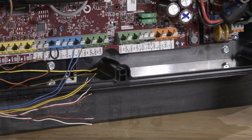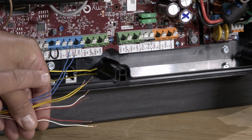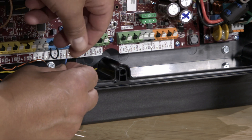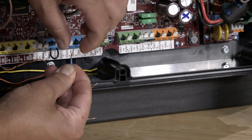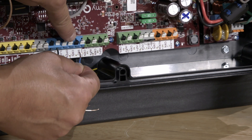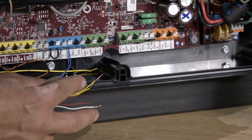Once at the power head, we will wire all open and closed circuits in parallel. To do this, twist the blue open wires together and insert them into the new push and plug quick connections. No tools are required. Simply push the terminal up and insert the wire. Releasing the push tab will lock it in place.